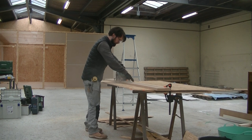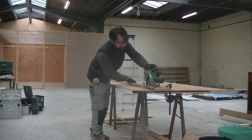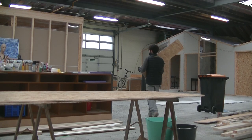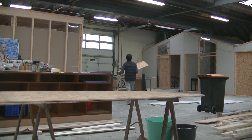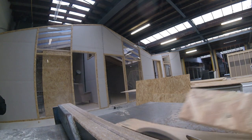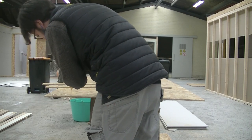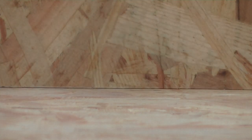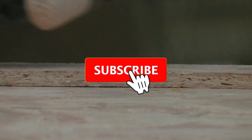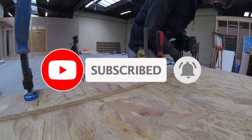I've showed you earlier how we set up a big space and a cool little set of stairs. The reason why the sliding doors are in place here is because of budget and modularity. All the spaces have the same door openings but all the frames and the concrete floor is different. These sliding doors are very forgiving with those discrepancies. This is an old building with an old concrete slab so the height is different here and there.